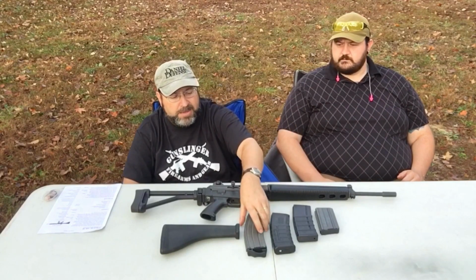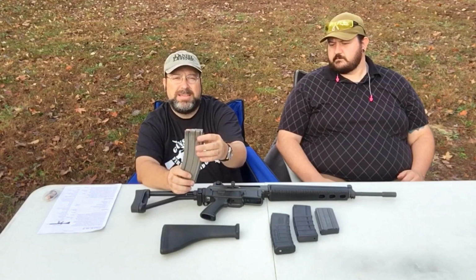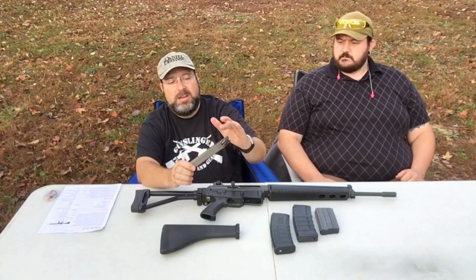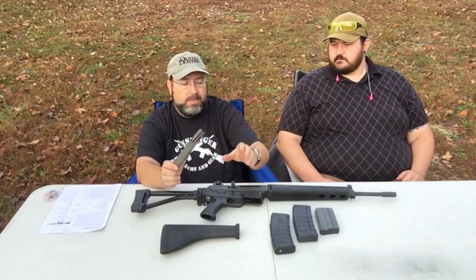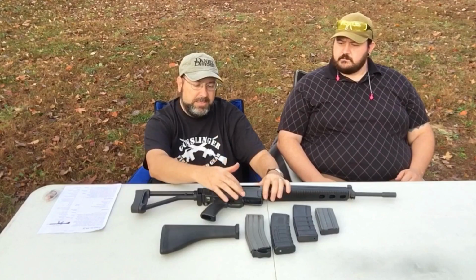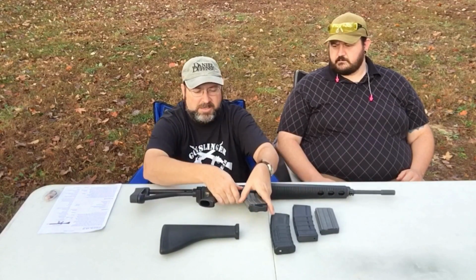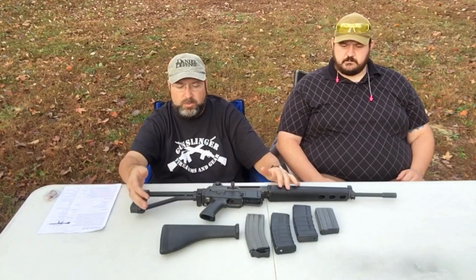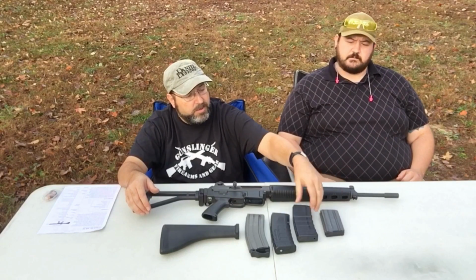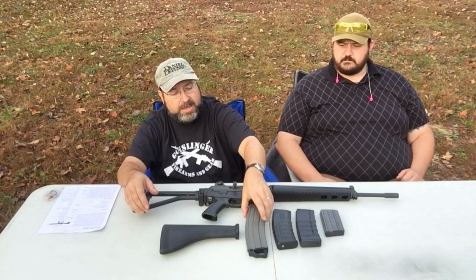The one thing that I saw though is you couldn't use a stock AR-15 magazine. They had their own magazine. It was derived from an AR mag or an M16 mag. You had to make your own cut in it to get it to work. That's something Armalite fixed when they brought out the AR-180B: it takes AR magazines, so no need for any custom cuts. It will feed out of any AR magazine. Like we've got a 20 rounder, a Thermold 30, a Pmag, and a government mag.